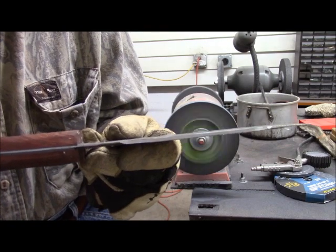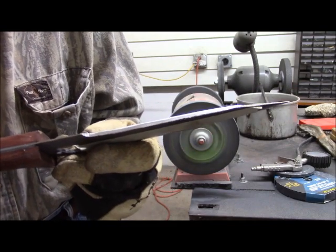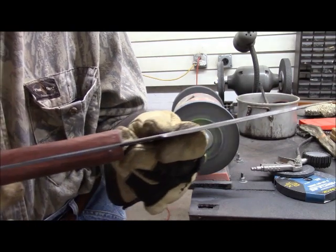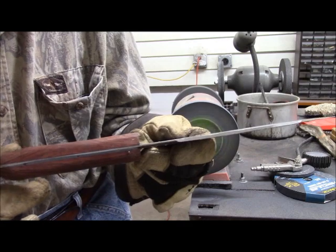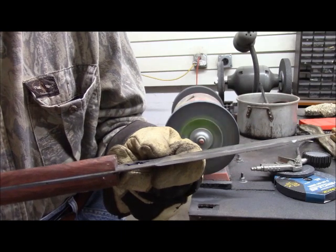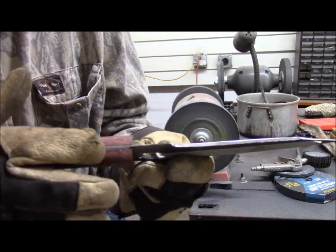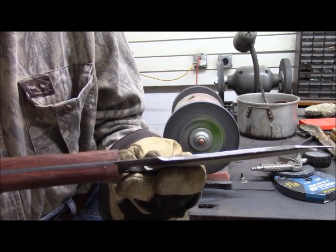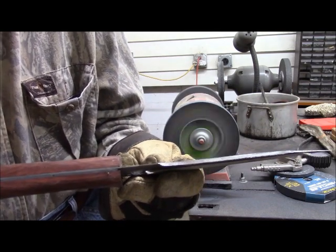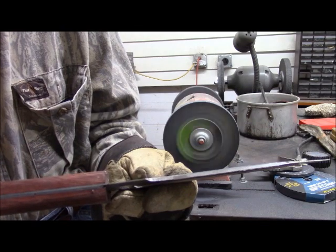Our grinding has got about halfway down to where we want to go, but you can see the great differences between the thickness of the steel between here and here. And consequently, the problems I had in mounting the scales, in that this portion of the blade equally had a sharp slope to the top. The grip was not absolutely flat, and so we used a large amount of epoxy here to make that seal. And that is JB Weld. And we're going to have to break these scales off of here. And we're going to try to extract them, but that's going to be difficult.